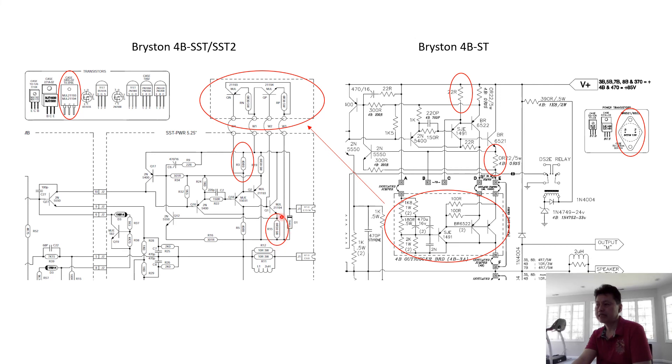Because the transistors are in parallel, the equivalent resistance is about 0.15 ohm — similar to the older one. But by eliminating the serial topology, we get a much better damping factor and lower output impedance. That's what we're going to do. In the next session I'm going to show you how to replace all these components and change the topology. See you next session.